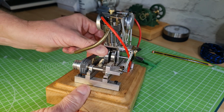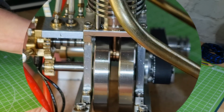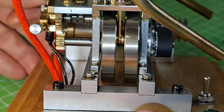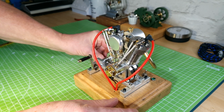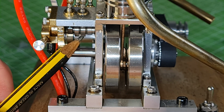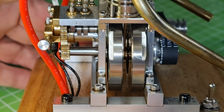First up, the open crank design. Without crankcase or covers, we get a view of the cranks with a glimpse of the big ends as it rotates. By leaving the Hoglet naked, as it were, without any covers, we can see how the pushrods operate from the little camshaft. This is geared down to half speed from the engine drive shaft.